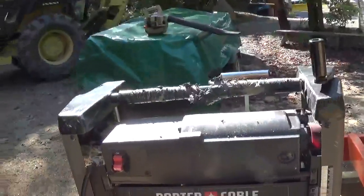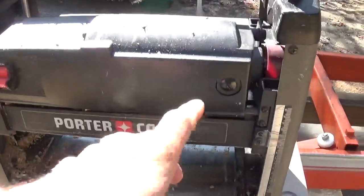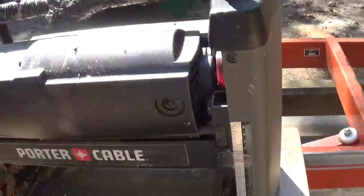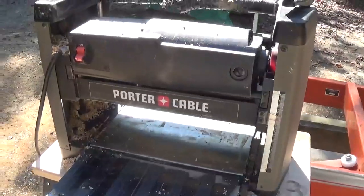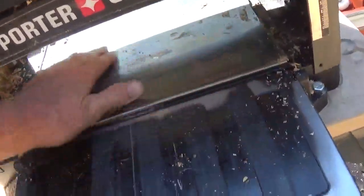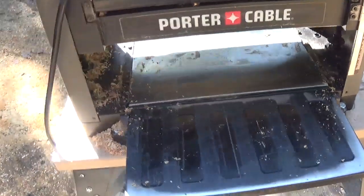There are a lot of ways to do things and I'm not claiming to be the number one guy to listen to. Here's what I did: I took the caps out, took the brushes out, wiped them off, and took my leaf blower and blew the stuff out. There are vents here that blow the sawdust out. Every now and then you have to do that to clean it up. Make sure you're unplugged when you do these things. Also, because there was a lot of pine yesterday, there's pine residue on this flat area here that needs to be cleaned off too.